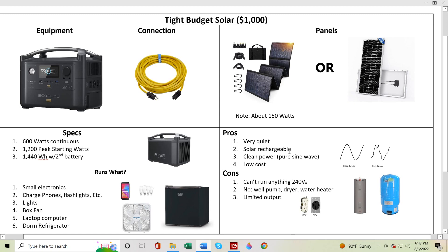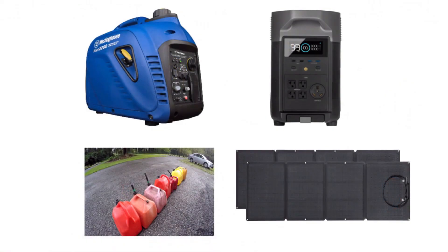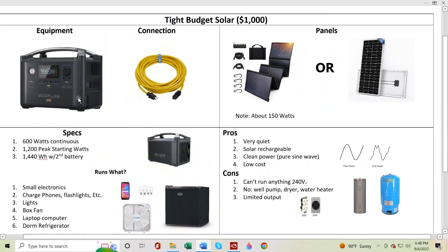It's very quiet — basically silent except for a fan. The neat thing is you can recharge it. If all you have is a generator, eventually you run out of gas. Once you move into the solar world, this will run for months or years, but you'd eventually be down to just whatever you can collect on the panels — and 150 watts is not much. It is clean power with a nice clean sine wave, low cost, but it's not 240 volts, so no well pumps or anything big. Think of it mainly for small electronics. A second idea: if you combine this with a small gas generator, you can charge it up quickly on the generator, then shut the generator off and run off this unit for maybe four or five hours. Used in conjunction, you can make a stronger combined solution.